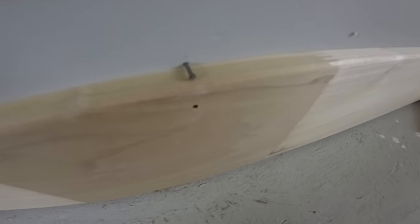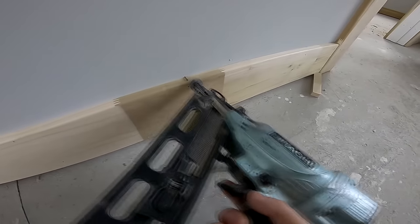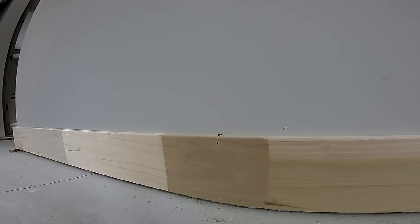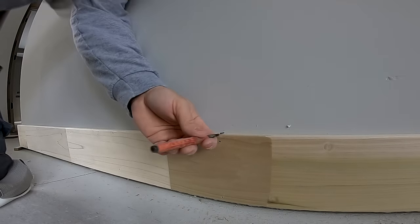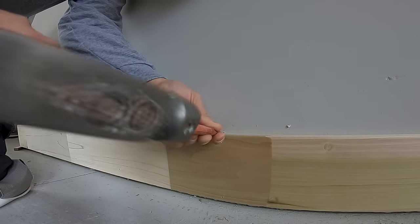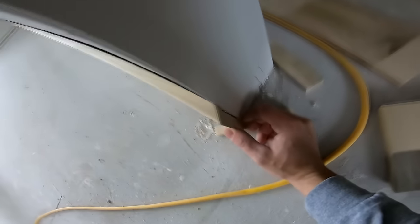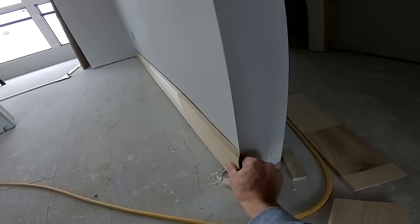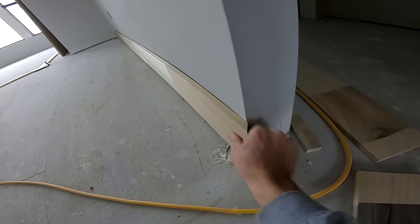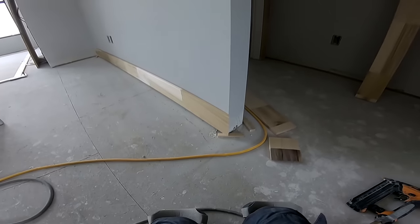There are the joys of shooting a nail right across the top of the baseboard when you get carried away. The worst are the ones that graze the top of the baseboard and splinter the wood, so always take your time and don't do dumb stuff. Also, drywall is somewhat fluid — if you've got a piece that's a little bit long, pull it back, give it a hard push, and that'll actually clear the mud out of the way or dent the drywall a little bit and it'll fit.